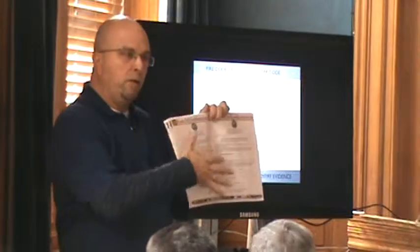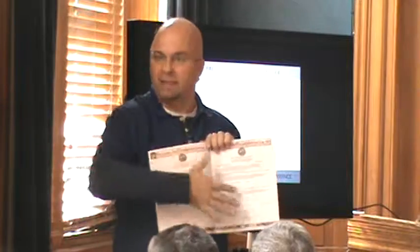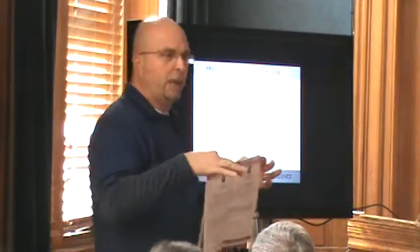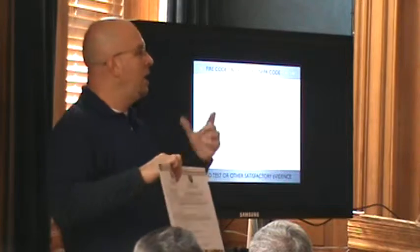There's one coming from Massachusetts from some of the Harvard buildings. This is the preliminary and the final — it's still a construction control document. We just inserted language about fire escapes. If anybody wants to check it out with their legal department, we changed no language other than inserting fire escape specifics. Here's another thing that will scare an engineer into doing it right: please provide a preliminary affidavit and all your information so we can talk about it, and tell me who's going to be paid to oversee it — called engineer oversight: three visits, an initial visit to kick off the vendor, a mid-visit to see if he's doing it correctly, a final visit to make sure it was done correctly, and a confidence test sign-off.